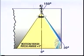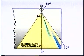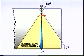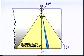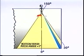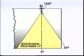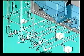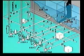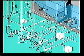During tank cleaning, it is ballast from the slop tanks that is used as cleaning water. You must work with a completely closed system, recirculating the used washing water so that oil is not pumped into the sea. To minimize the risk of overflow, don't forget to set the slop tank high-level alarm to 3 to 4 meters. This will give you time to react when necessary.